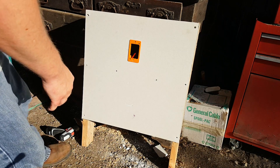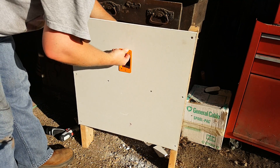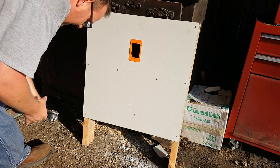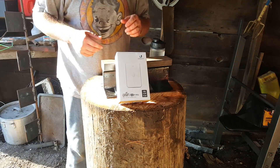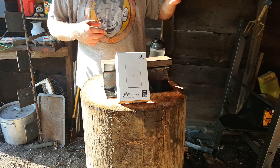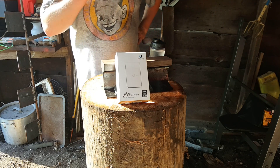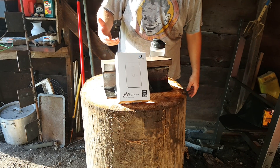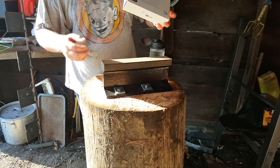Now what we've got to do is move these tabs around so that as we tighten them they grab the drywall and tighten up. So what we've got here is the Ubiquiti UAP-AC In-Wall. Ubiquiti has several models of the in-wall access points — they have a model that has 2.4 GHz only, this one, and one labeled as the Pro. I can't remember if the Pro replaced this, but if you're a member at the beta store there is also the HD.